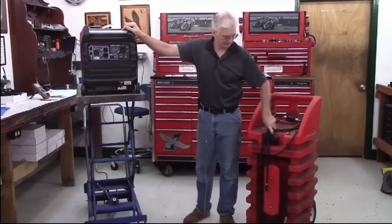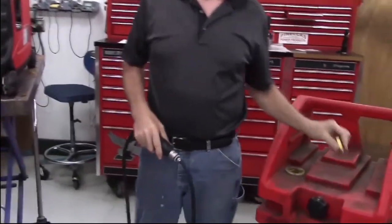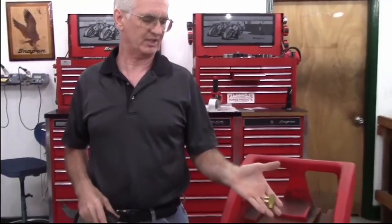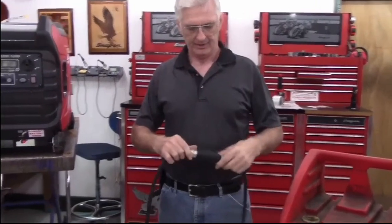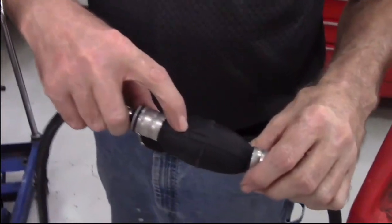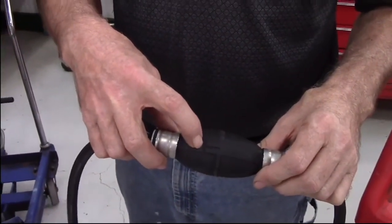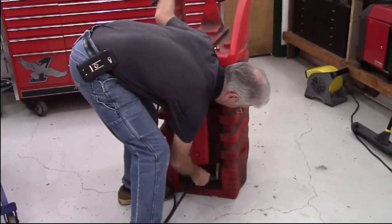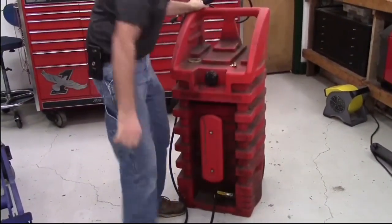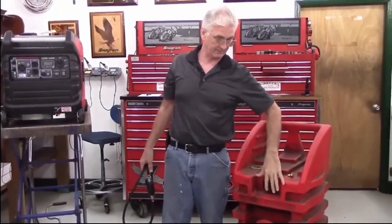The operation of the system is very simple. My kit does include the quick disconnect fitting, which goes on the fuel tank side. The hose is a genuine Yamaha hose and has genuine Yamaha quick disconnect fittings already fitted onto it. There is an arrow that indicates the direction of fuel flow — fuel flows from the tank to the generator. We'll connect one end to the fuel tank, turn the fuel valve on, and then make sure the fuel tank vent is in the open position.